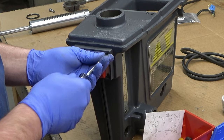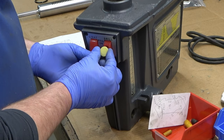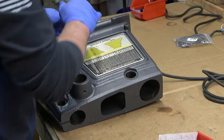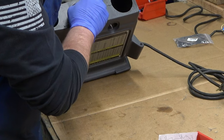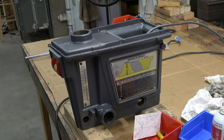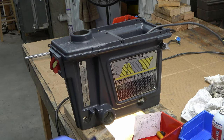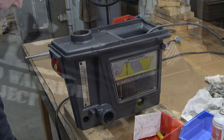After we've got all four screws tightened down, the last thing is to insert the safety lockout on the motor side switch. Then we insert the light bulb into the bottom — I like using a bright LED daylight bulb. We'll plug it in and test the switch panel: the light works, and the motor side has a heat gun plugged into it to confirm it turns on. We're also making sure we're not getting any electrical coming through the head casting itself. Good to go.